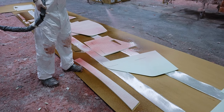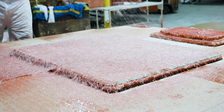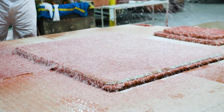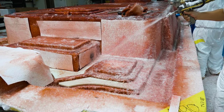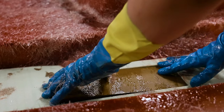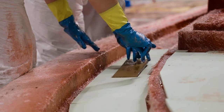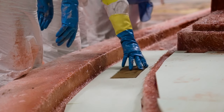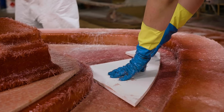The coring materials are pre-sprayed with resin, and a wet bed of fiberglass is laid down on the deck before applying each piece. Additional fiberglass is applied over the top to encapsulate the composite materials. A key advantage is our strategically located composite materials — for example, AquaSteel is placed around the deck where traditionally a backing plate would be used. These areas include cleats, hardtop legs, leaning posts, and much more. A growing trend of trolling motors on offshore boats has driven us to design in additional supports at the bow for proper installation.